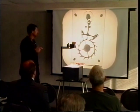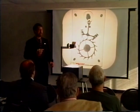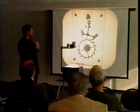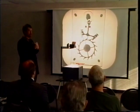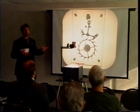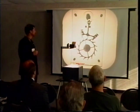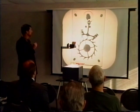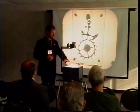And where I have problems with that is that when you draw the lever escapement with Henry Fried, he talks about the pallet fork and the contact that the pallet fork is in with the jewel. And that's 10 to 12 degrees on an escapement. And so I had to think of it differently. But anyways, yeah, that's your angle of lift. Okay? All right.